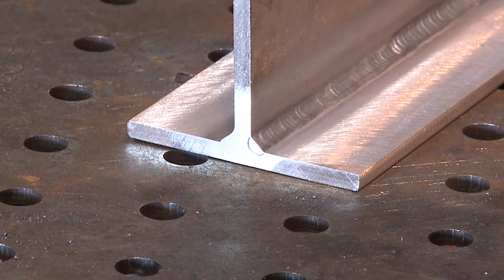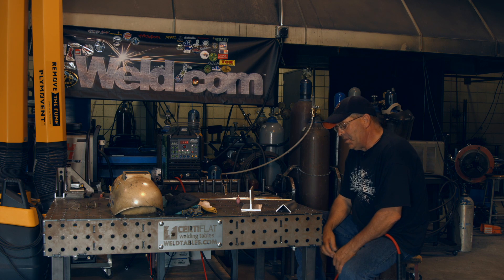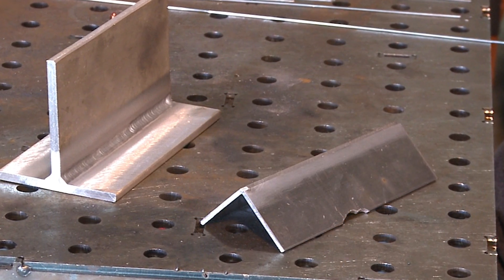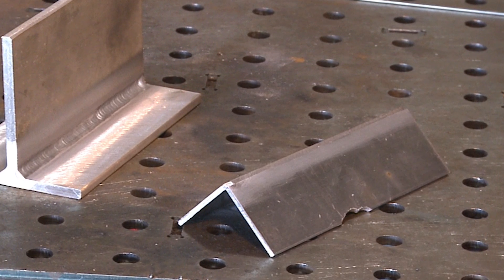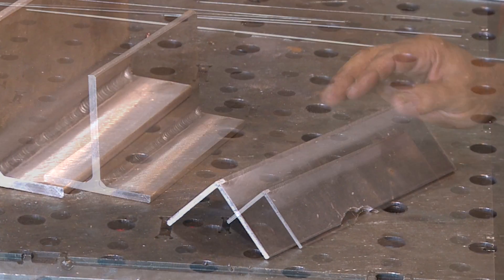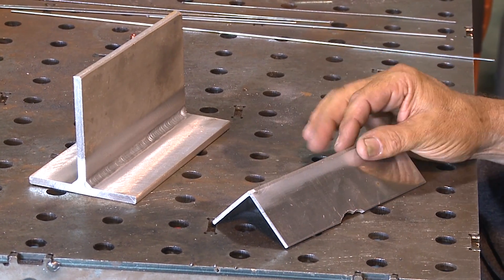I believe this is the original piece from that video — I remember the pencil mark we put around the grain. Now I'm going to do something half that thickness on an outside corner joint. Think about that for a second — a lot of power to get into a fillet weld and make it perform correctly. This joint configuration is heat sensitive by its very nature.